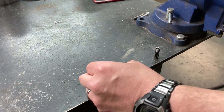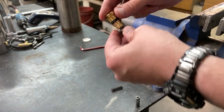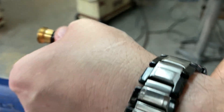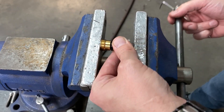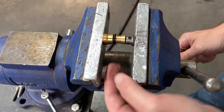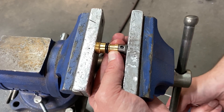Make sure the unit is complete. Replace the old spring with the new spring and replace the brass covering on the steel housing again with soft jaws. Then gently clamp the housing together, making sure that it's straight the entire time — slight adjustments may need to be made.